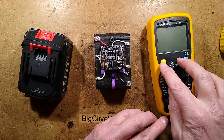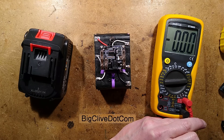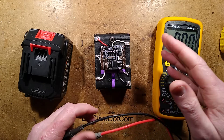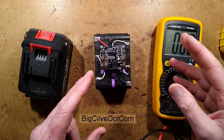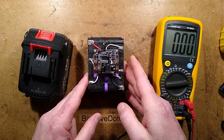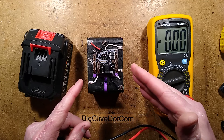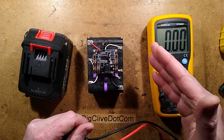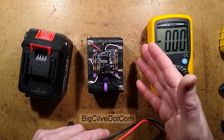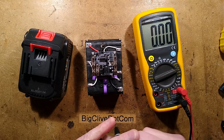This is one I've attempted to charge up. There is a point you shouldn't recharge cells, and there are two schools of thought on this. As soon as the cell goes anywhere below 2.5 volts, that's it - it's finished and you shouldn't attempt to recharge it. The classic TP4056 module will trickle charge them back up to 3 volts and then kick into full current. But if you've really mega-discharged the cell, I wouldn't recommend using them at super high current - that's exactly this sort of application.